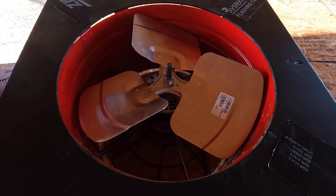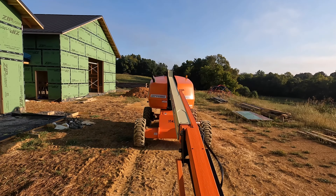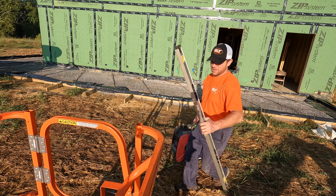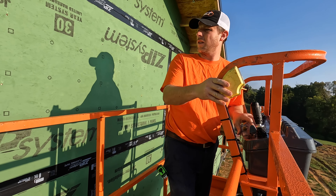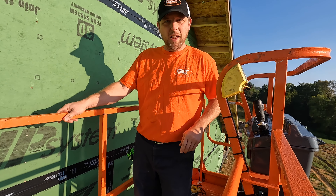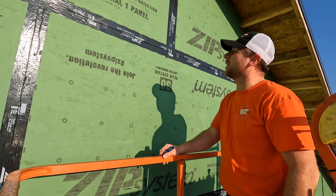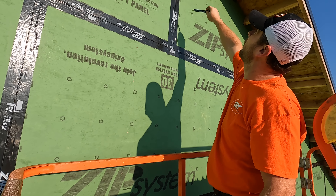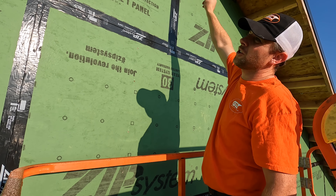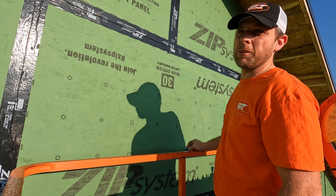That should work for a pretty decent template — let's see if we can go cut a hole. I went inside and got a measurement on where my framing members were. I'd really have liked to get it up in the peak, but I'd have to cut through my truss and redesign all that. So I'm going to put it right here — we'll be within four feet of the top of the roof and I think it'll be fine.